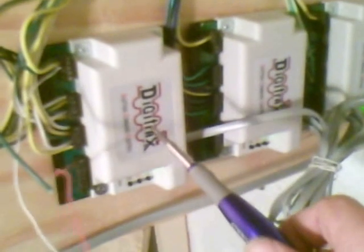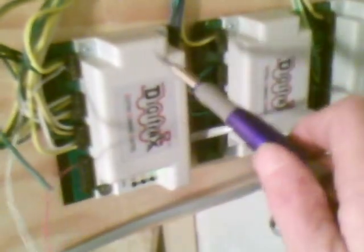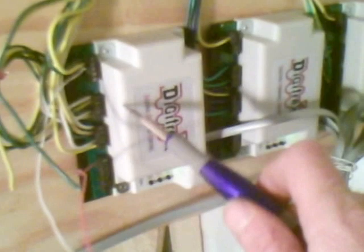I've pretty much got the layout wired up and just got some decoders put in, so I have a couple of units. I still need to get some BDL-168s — block occupancy detectors — which will also be wired up into the DS-64s. That's why I haven't gone too far with my wiring. When this is all done, I'll have block occupancy detection, especially inside all my hidden staging areas.